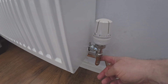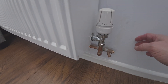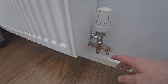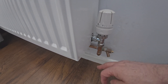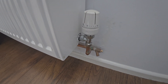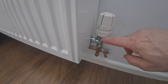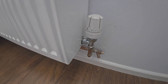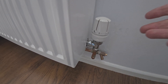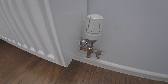One thing you will notice is that the copper piping is all left bare. It's up to you — some people will paint this to match the wall. Personally I've been told: don't paint it, because if you do need to make any changes, it can be a pain to get the paint off if you need to redo any of the joints. They will also fit TRV valves to every single radiator. You don't need them, and in fact the recommendation from my plumber was to leave these fully open — otherwise you're putting stress on the heat pump by closing them down. They're really not needed, but as part of the MCS requirements they have to be fitted to every single new radiator.